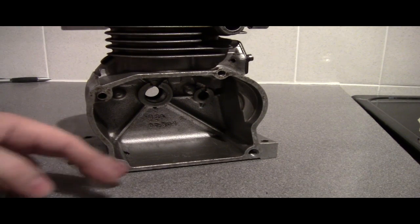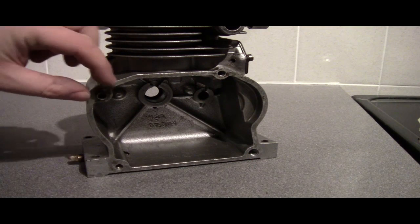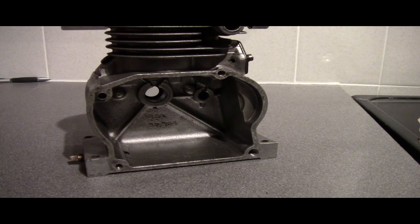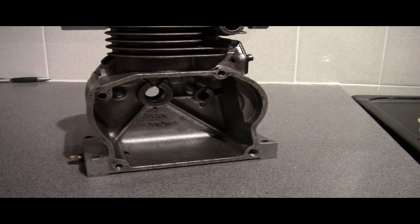If I had repaired it in the normal way, the hole would be too large to be able to hold the locating tube. So what I'm going to have to do is go on the lathe and create my own thread insert, just like a normal helicoil kit, but also with a built-in locating stem that comes out of it.